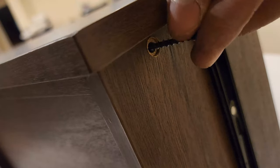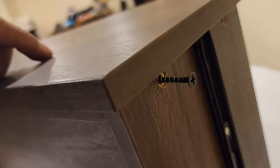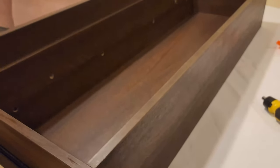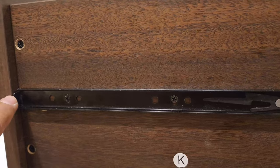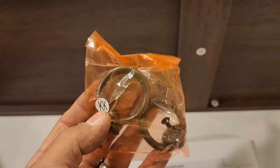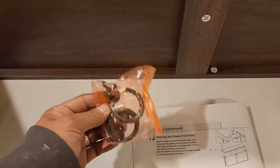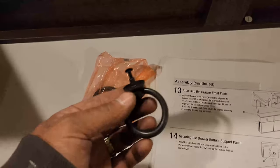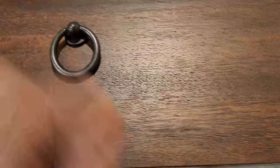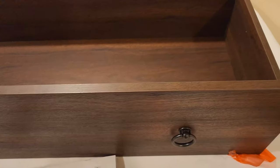When making the drawer, make sure the finished side faces the back so everything looks finished. The brackets have a stopper and there's a clear path in the back. Now you have two handles — part number KK — and they go on the front of the drawer. Remove the screw, take this off, the screw goes to the inside of the drawer, and the handle goes on top. Put the screw in from the bottom.